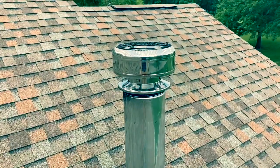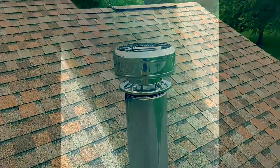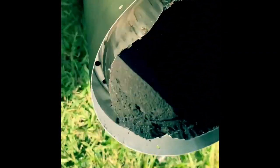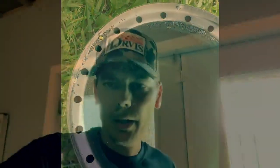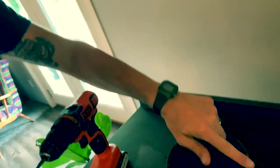We're back down to the basement. I have now removed the top piece, and this should be the nastiest of all of them — and you know what, it's not that bad. I probably could have got another year out of this, but better to be safe than sorry. You don't want to have a house fire or a chimney fire. After everything is done and scraped, I'm going to clean around the bottom base of where the pipe comes out. There's a little bit of rust build-up I'm just going to scrape off, then we are ready to reassemble.